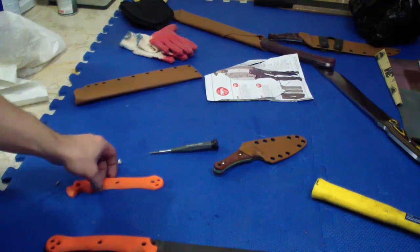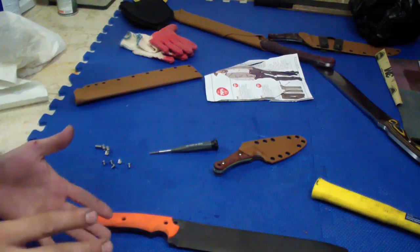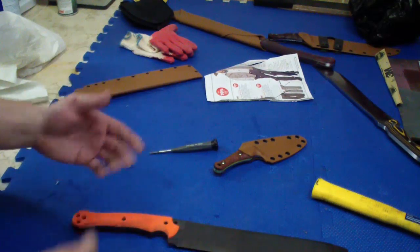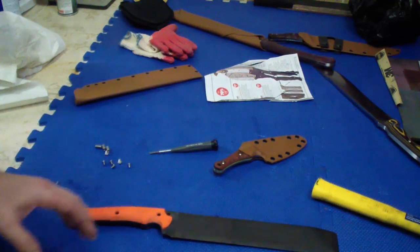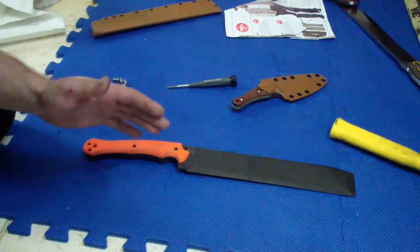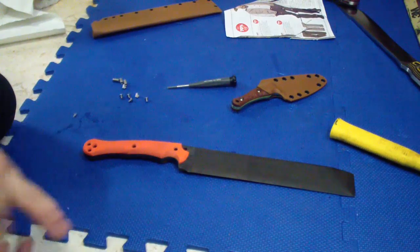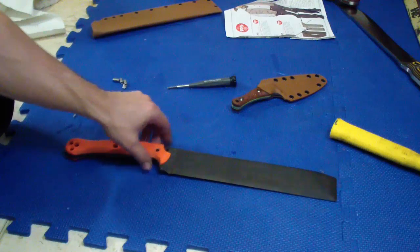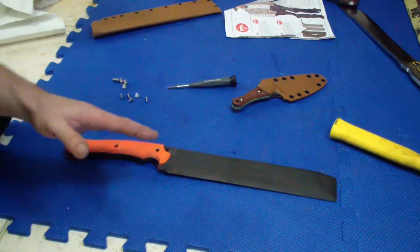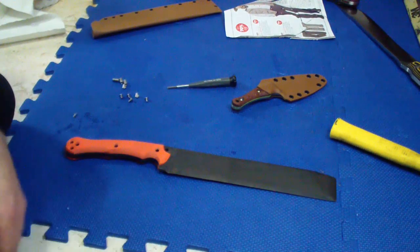Just put the handles back on and that's it. One thing you can do — you can actually make a simple tumbler from the same PVC piping. Grab a bigger one, get a little bit of stone-washing media, throw it in there, put the blade in, and just shake it by hand. Stone washing after an acid bath is much quicker than a regular stone wash because the surface scratches very easily — literally a couple minutes of hand-shaking gets the job done. You can see examples of this on Jeff's Stufftamsix channel. I personally keep it uniform because the coating is there for rust prevention, not looks — scratching it would just expose the steel again.